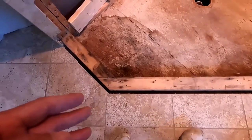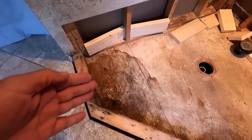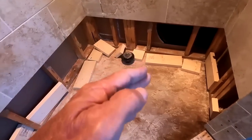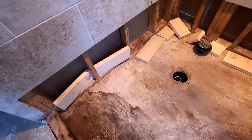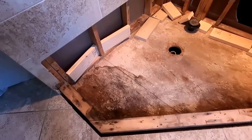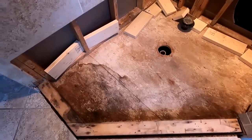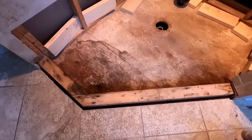But you can't really fasten this type of liner without using thin set. So I'm going to screed out thin set along all this blocking and wood from that 6 inches down, kind of butter that whole area, and then when that's dry, I'll be able to wrap up my liner and stick it to that with some thin set. That's usually how I do it when I have metal studs. The fleece liner has a purpose. I don't do it all the time, maybe once or twice in a year, but for the reason I just mentioned, that's why I'm doing it.